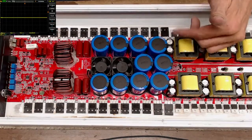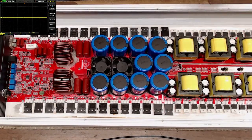And then, of course, you have your common rectifiers here. These are marked just like the Sundowns. They're S7, S8s, which I'm assuming are probably 30 amp rectifiers. I don't know exactly what style of rectifiers they are, but I can't imagine them being much higher than 30 or 40 amps, because those are just absolutely hard to find when you start getting that high in the TO247 style packages.